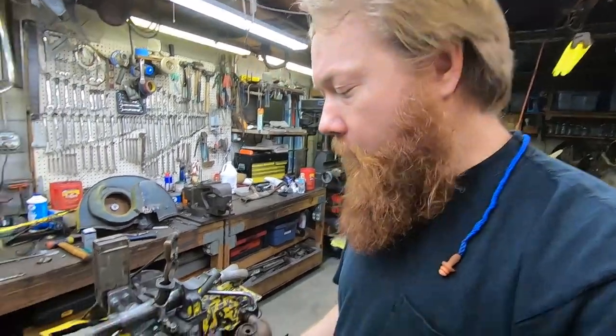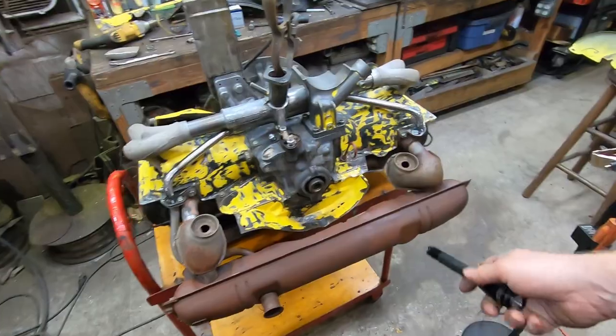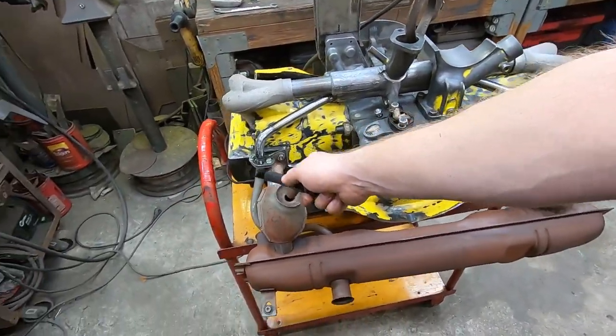On most aftermarket exhausts, it's a pulsing back and forth. One fires and then the other fires, but there's not a throughput of exhaust gases through the heat riser. So it just ends up clogging up and it doesn't flow as much gas. So it never does its job as good as it could, and it'll eventually get really clogged up because that soot doesn't ever make it all the way through the heat riser. So in the future, I can see myself choosing to use an aftermarket exhaust that needs to be modified to flow like this. With a little bit of experience finagling this one, that's going to set me up to where I won't be quite as clueless when I attempt that.